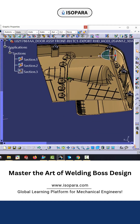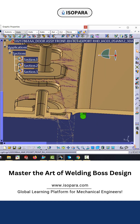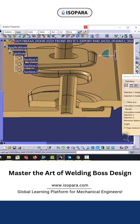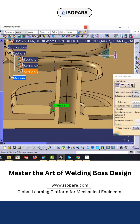I will show you by showing the cross section. So here it is — this is basically a 6mm diameter welding boss. We have to maintain a gap of 1mm here, and another important dimension is we should maintain at least 10mm height from the environment part, as you can see here.